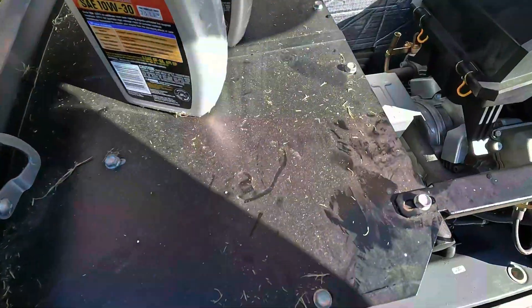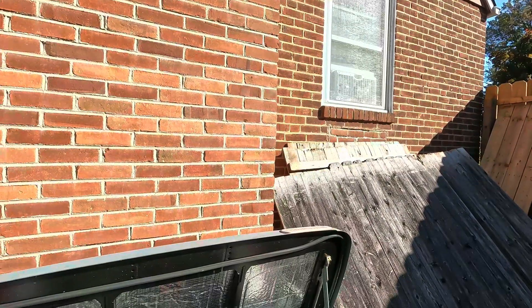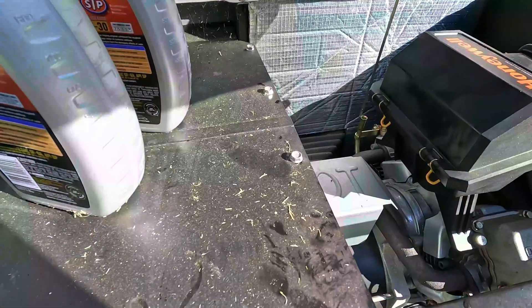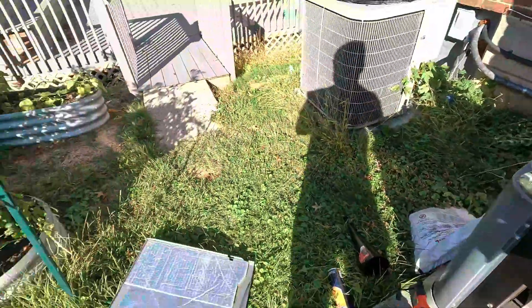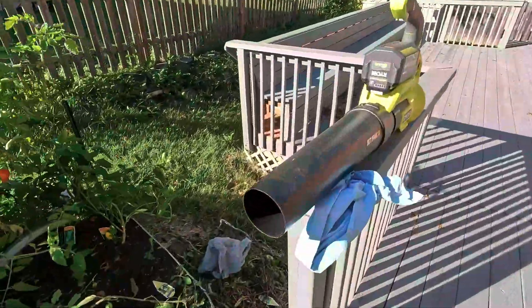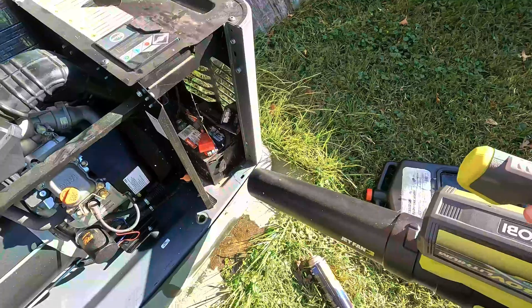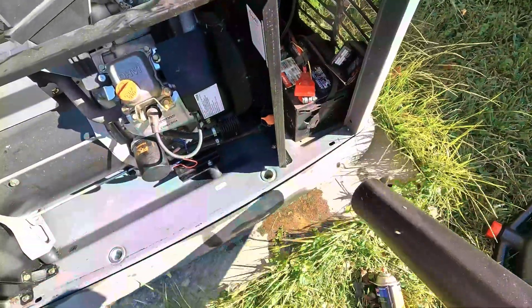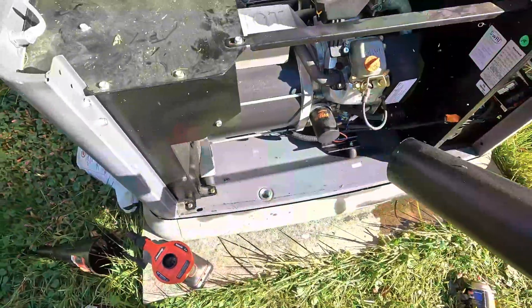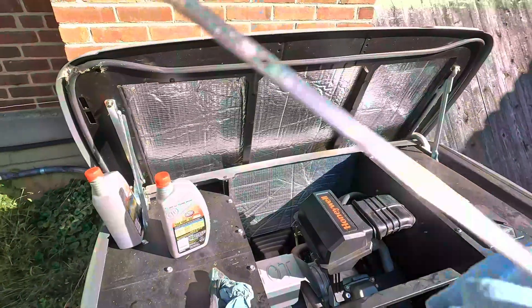It's hard to tell, so I'm going to give it one more dip. One and a half quarts is enough, at least in my generator — that's how much came out of mine. That's how you do the maintenance. I'm going to take this leaf blower and blow everything out, make sure I clean all the spider webs and whatnot. One last time we're going to check the oil just to make sure it's right after all the oil has settled.